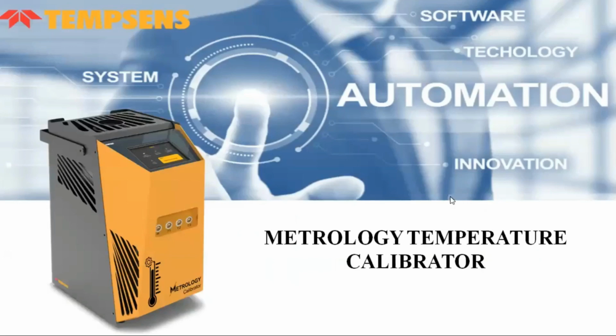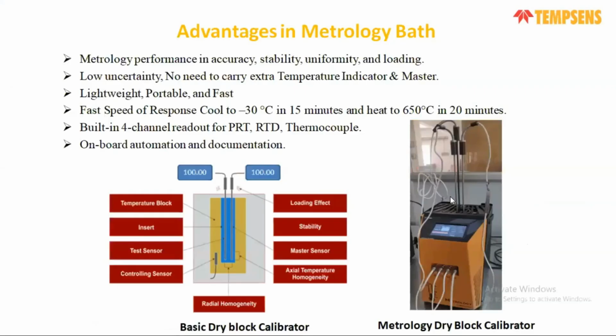So today we are going to discuss the metrology temperature calibrator. This is a very accurate temperature calibrator and has very low uncertainty in comparison to our normal standard dry block temperature calibrator. For a basic dry block temperature calibrator, as in the diagram on my left-hand side, it is nothing but a comparison block. We put in the master sensor, heat the chamber, and once it reaches a stable temperature, we compare between our test probe and the master sensor. That is the basic dry block calibrator operation.